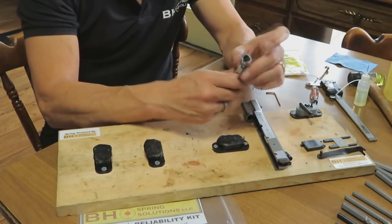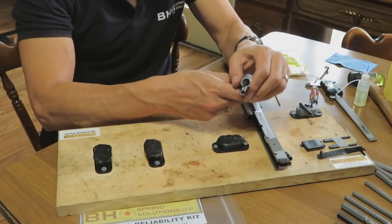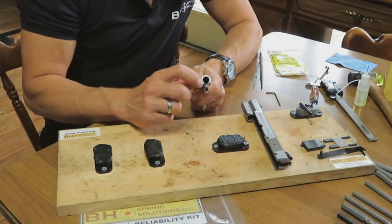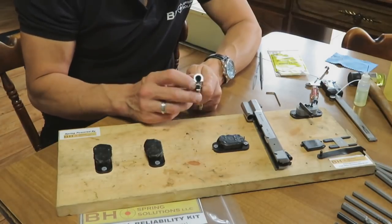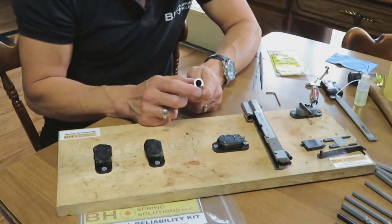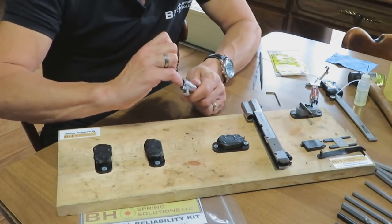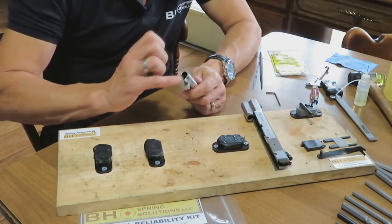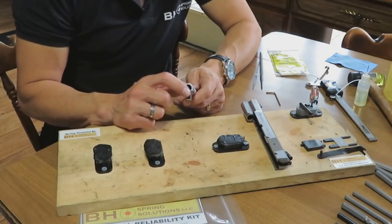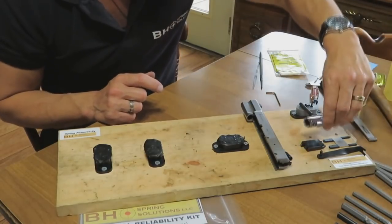The barrel did prove to be defective because of the location of the chamber relative to the bore, but we won't focus on that today. One thing to discuss is the polishing kit that comes with this product. Polished feed ramps always function better than non-polished ones — this is a polish point right here, all into the entrance of the chamber. Polishing this area is a plus. Polished feed ramps have fewer collection points for carbon fouling while shooting.